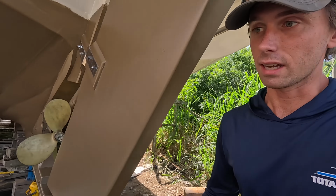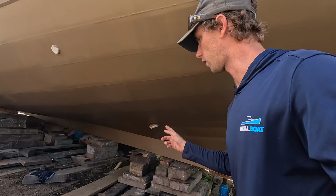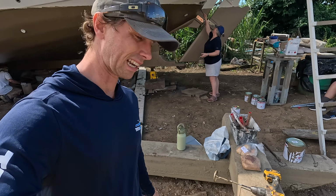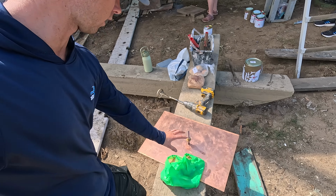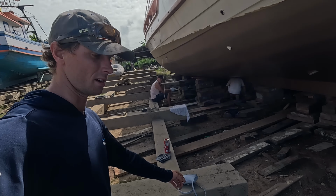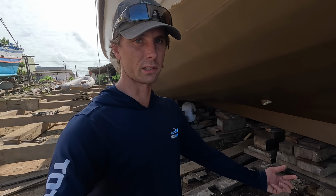Very good that we came today and can see everything during daytime because we saw a few spots that were slightly thinner than others. It's also good because before actually adding the anti-fouling itself, I'd like to add the grounding plate. I just want to go and get lots of sealer and screws. The electricians, Oli and MP, have already decided where that threaded bar is going through the inside of the boat for easy access and practicality.